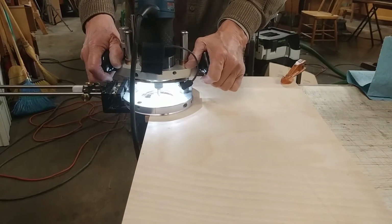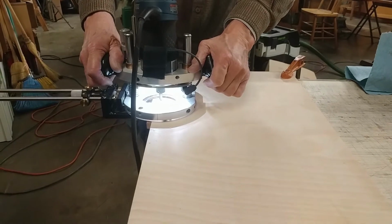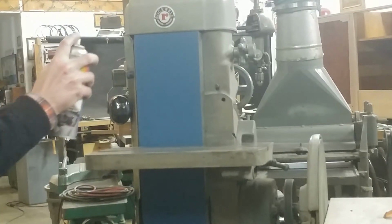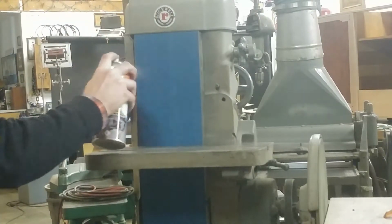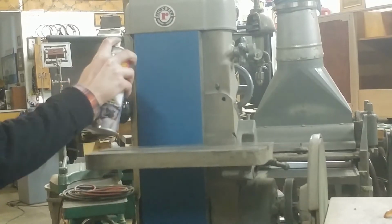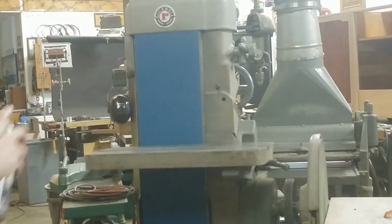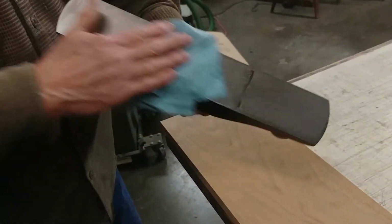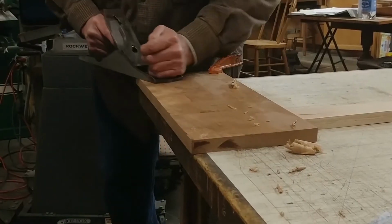We use it on cutting tools, we use it on the bottoms of routers, on plastics, on wood, and on metals. Even on abrasives, we found it extremely useful for extending the life of the paper and keeping the cut strong and clean. By lubricating the grit of the sandpaper, it eliminates heat buildup and prevents clogging on the paper, so you get a much more extended life.